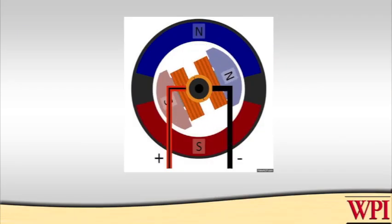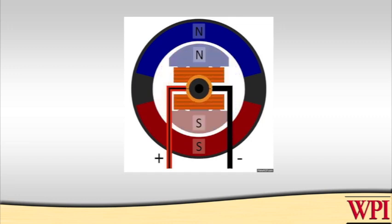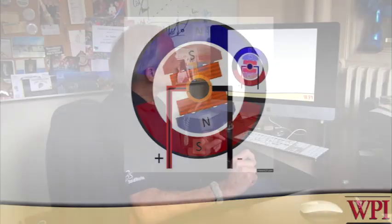Now we've seen what it looks like in real life. In this diagram, the electrical conductors through the brushes interact with the commutator. The cool thing is they switch the sense of the magnets in the electromagnet part of the armature. One thing which is not clearly understood: a DC motor, which takes DC power from a battery, actually changes that into alternating current inside of the motor through the mechanism of the commutator. And in fact, every motor does that in one way or the other — there's alternating current happening to make the electromagnets continually spin.